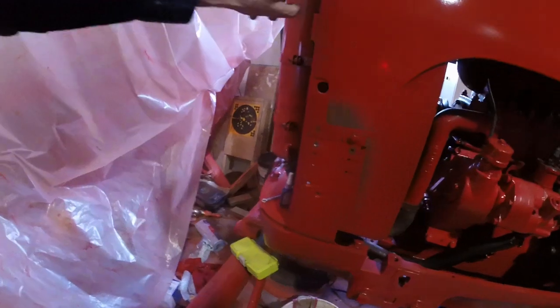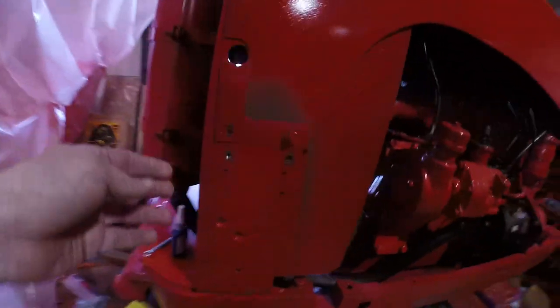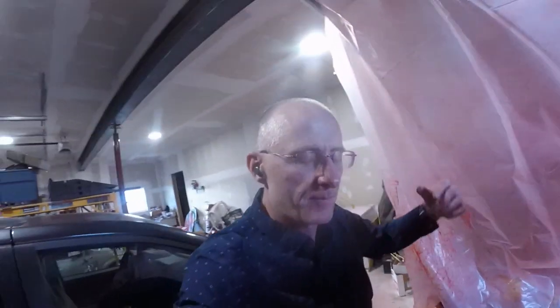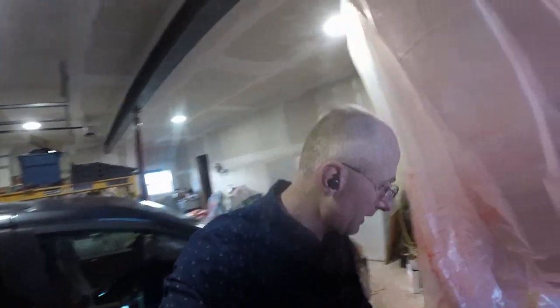I went to put my grill in, and I recognized that almost every single one of the grill bolts or the threads, quarter by 20 threads in this little quarter inch piece of the radiator housing, they're all stripped out or worn out. And I thought, well, this will be a good opportunity to just use a helicoil style threaded insert.